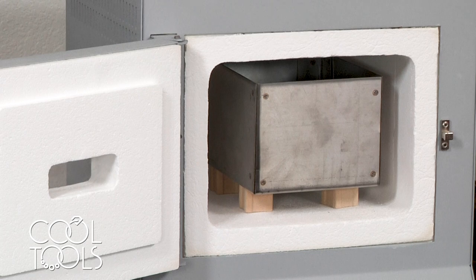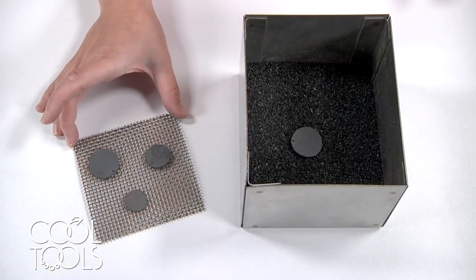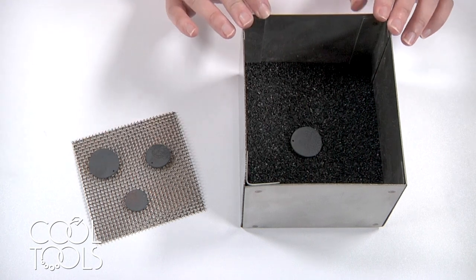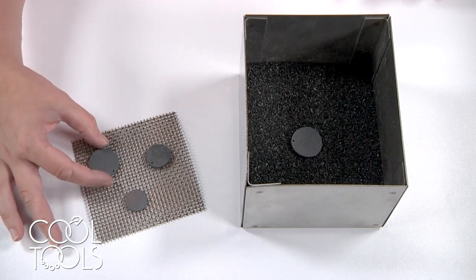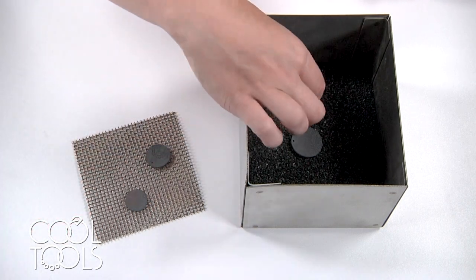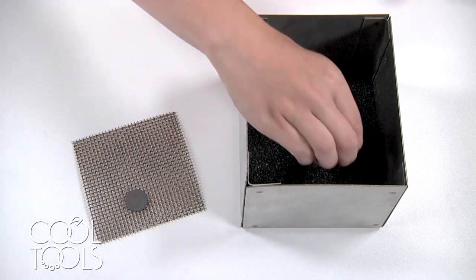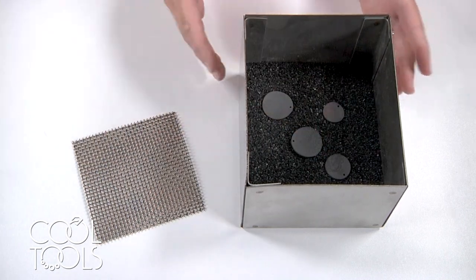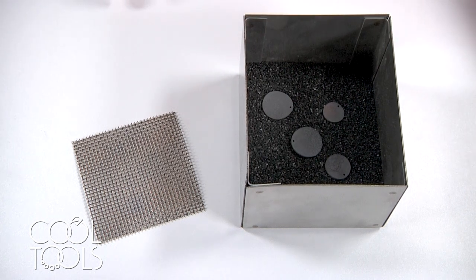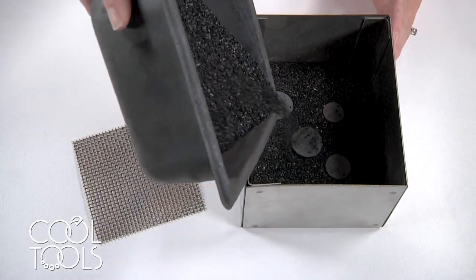Once that firing is complete and your work has cooled, you're ready to move on to the second phase. If you used the mesh rack method, transfer your pieces from the mesh rack to your stainless steel firing bin with an inch of activated carbon on the bottom. At this point all the binder has burned away and your pieces will be more fragile than in the greenware state, so be very careful when moving your work. Consult your firing instructions for guidelines on piece spacing — Cypress Copper Clay recommends at least half an inch between pieces. Place your work on top of the activated carbon, then add an inch of carbon over top your pieces, as Cypress Copper Clay recommends.